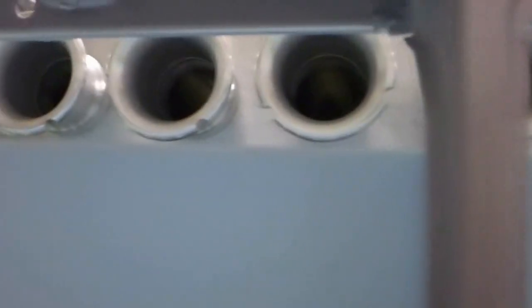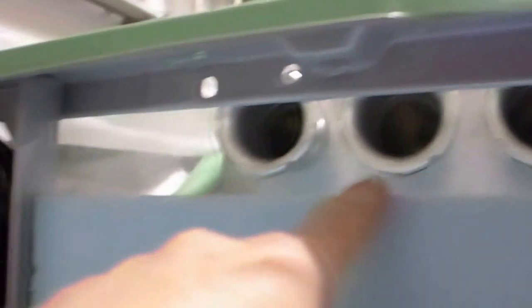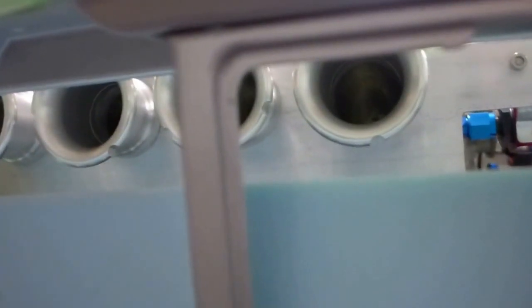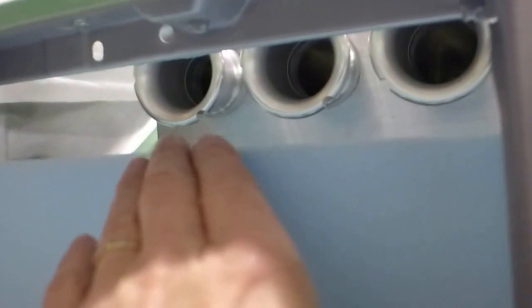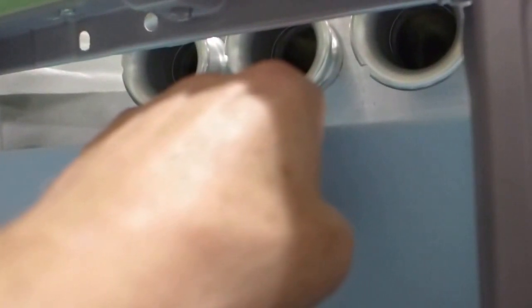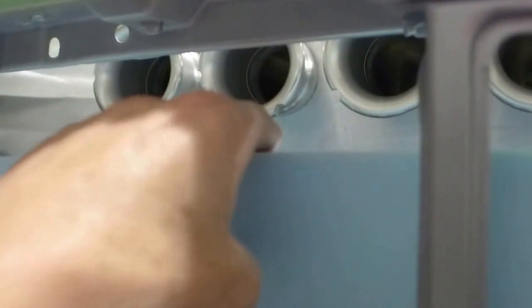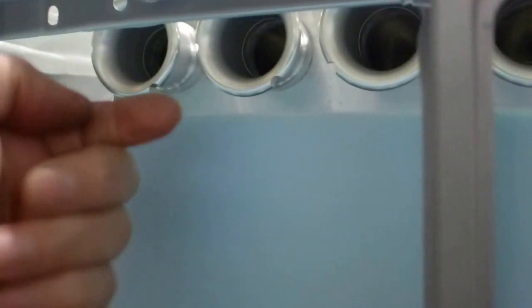was a smart move. So what I'm doing is I've got 2 K&N air filters, 2 3/4 by 12 inch filters that mount on each side here, and then I'm just going to fill the center with some oiled foam, and I'll build an opening, basically a piece of polycarbonate or Lexan. It's going to come out and then angle down until it hits the grill, so it's going to grab air from maybe 4 inches and then funnel it in to a plenum that mounts here.